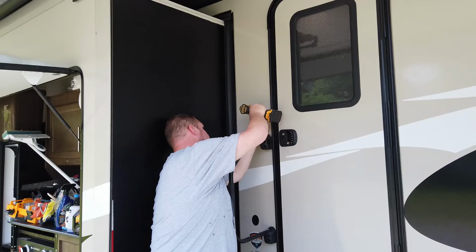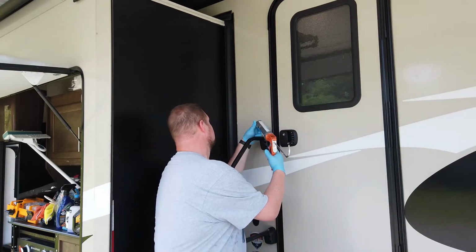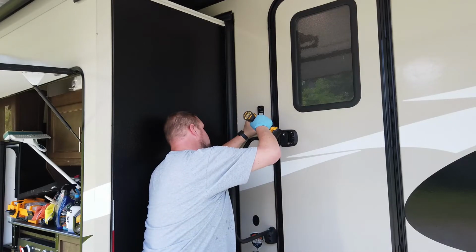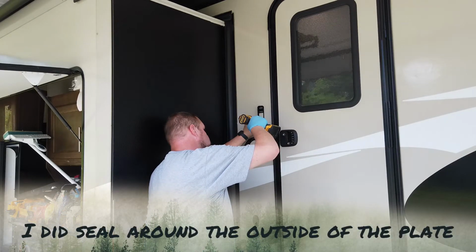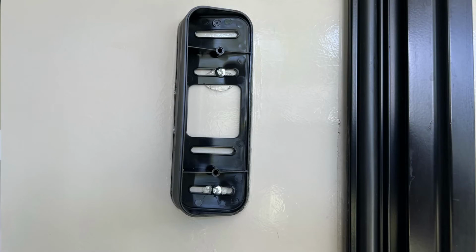But before you put the wood screws in there, what I would do is go ahead and get some sealant and put in those holes. That way it's going to seal up those holes as the screws go in. And then after you get the screws in, I would go behind and put some sealant around the heads of the screws and around all the little plastic areas that are open inside there, just around where the screw is, just to give it some extra protection.